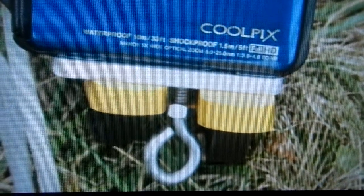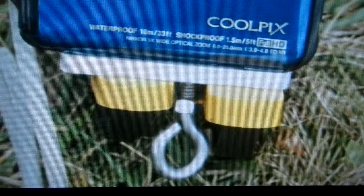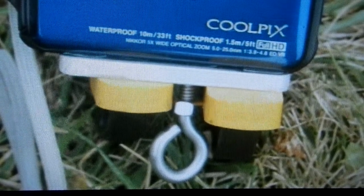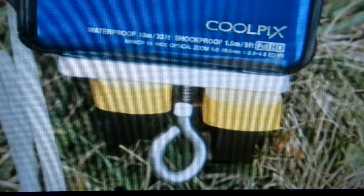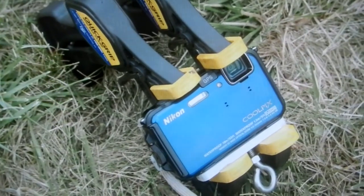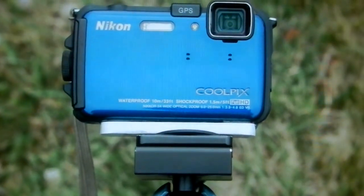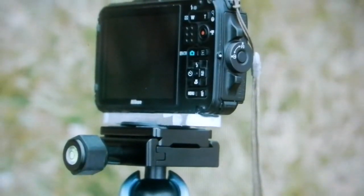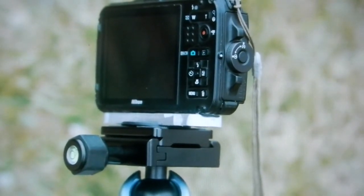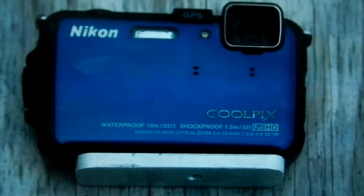It's very important to do that. If you want the quarter-20 hole to be in the same alignment as the original, which I did, it also helps in placement and keeps the plate stationary when you clamp it down — otherwise it'll tend to slide on you. Here it is completed. Once you allow it to dry, it's now usable on a tripod. This repair makes an excellent alternative to not being able to use your tripod socket. This worked out perfect.